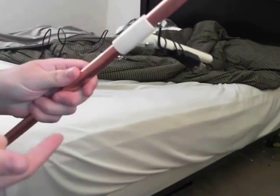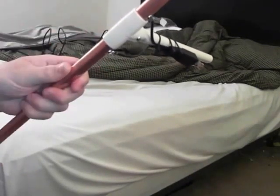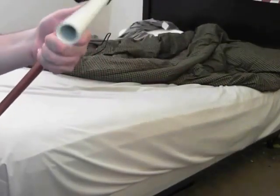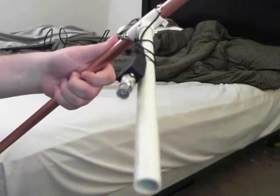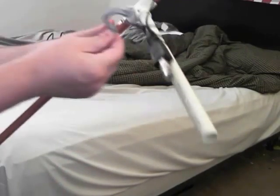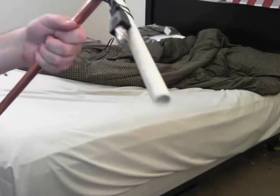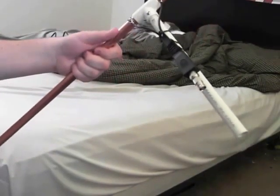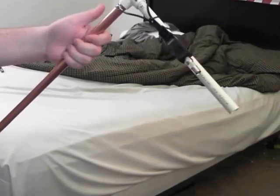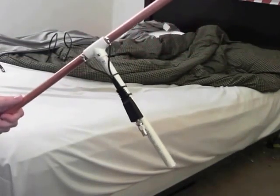For a more secure application you could drill two small detent holes and use half-screws to apply pressure and keep the pipe steady in the tube. This mounting arm is a piece of PEX pipe about 10 inches long. To mount it I'd put zip ties here and there. I might actually make an attachment to put this on a tripod or mast, getting it about 20 feet up in the air, since this is primarily for field use.